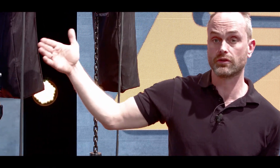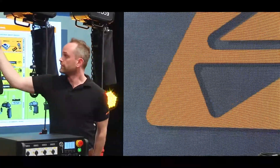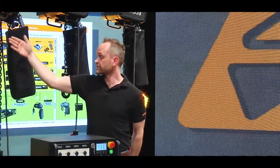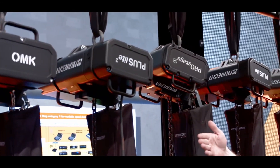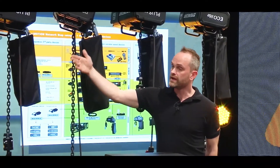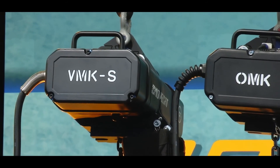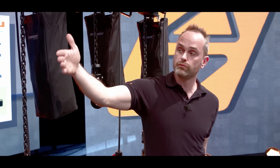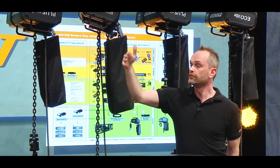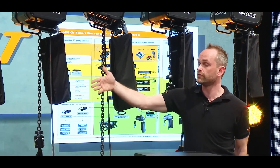This one has a second brake attached — it's D8+, so we can leave out the safety, but it's just half ton load capacity. Next one is a one ton D8+, again with two brakes. This one has some limit switches attached, again just a half ton. Then we come to the C1 range, where we added some temperature measurements and some way encoders. And the last one, we come to the very high-end VMK show-relevant stuff, which can go pretty fast, and everything is attached to it: temperature sensors, double brakes, double control, and frequency-converted speed ranges.